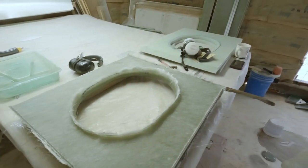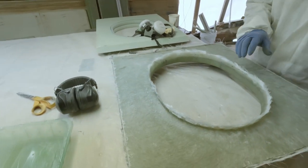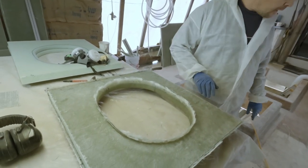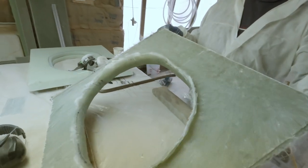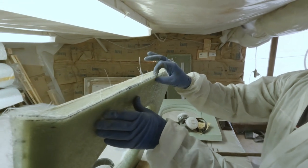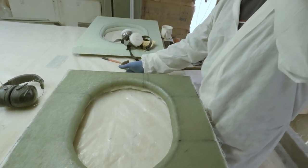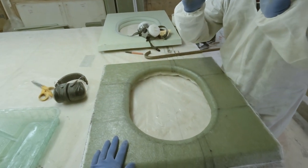The hatch is kicked off - it's all hardened up and looks pretty good. We'll send this to the trimmer and get it cleaned up. We're going to have to make a little adjustment to the notch that it fits in in the shaft alley stringers. We kind of changed course - we didn't really take into consideration the laminate on the bottom. At first we were just going to inset them in between the stringers.